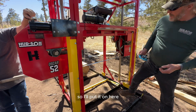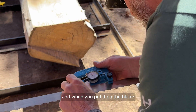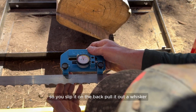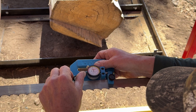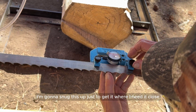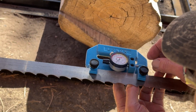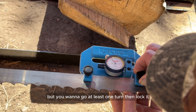So that's how it works. I'll put it on here and then tension it up to our 70 pounds and we'll see where we're at. When you put it on the blade, you want to make sure the back of the blade isn't touching this part of the tool because that'll affect the reading — and that's on both sides. So you slip it on the back, pull it out a whisker, tighten that, snug it up, then move the dial one full turn with your other finger. You can go past it, but you want at least one turn, then lock it.